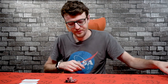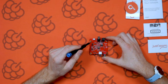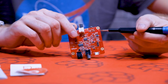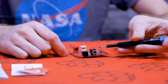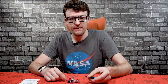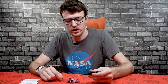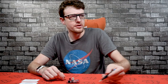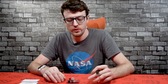Let's take a look at the board from the top. You can see a variety of connectors. This is the input side of the board, and up here you've got the outputs. As inputs, you need the five volt power — that's just a typical micro USB phone charger. We typically recommend using a Raspberry Pi power supply, as these are a bit more reliable and are high quality. They provide enough amperage for a good quality signal. For the DAC we'd say to go for at least five volts, one amp, but having two amp or 2.5 amp doesn't cause any issues.